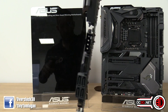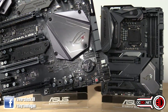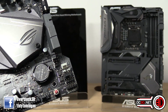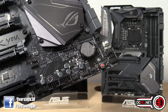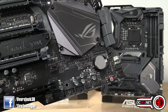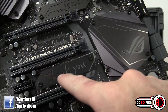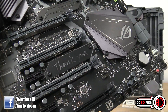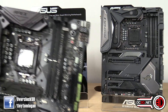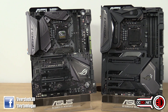There's USB 3 here, and extra power here — if you're going to be using a lot of graphics cards for benching, you don't need to plug that in for normal use. Down in the bottom left-hand corner we've got the water cooling section with water flow in and out temperature sensors. It's nice to see two USB internal headers as well, which most of us use for AIOs or power supplies. These badge inserts you can make your own — you get blanks in the box and you can either cut them out by hand or get them cut to size so they can light up, and you can unbolt and move them around as well. Two eight-pins is the other key thing to note, because at the end of the day it is their overclocking board, but it's also about the aesthetics.